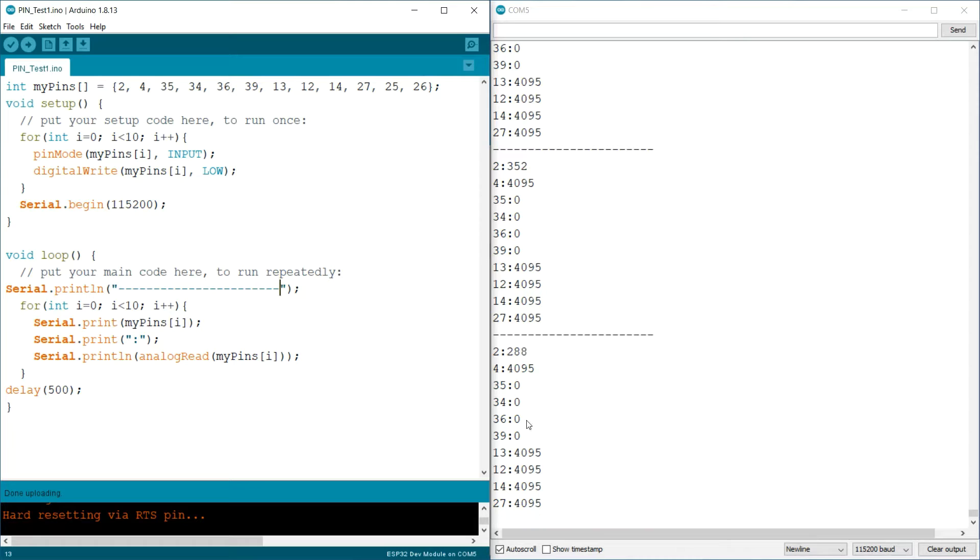It just shows all the values on those pins. I'll start from pin 39 and go back to number 2. Pin 39 shows about half voltage — that's okay. But I also see some parasite voltage on 36, and when connecting to 36 it shows some values on 39, so I shouldn't use both of them simultaneously. Pin 34 works nice. Pin 35 works nice. Number 4 — no reaction at all. Number 2 shows some difference, but not as much as expected. So I will use pins 35 and 34 in my project.